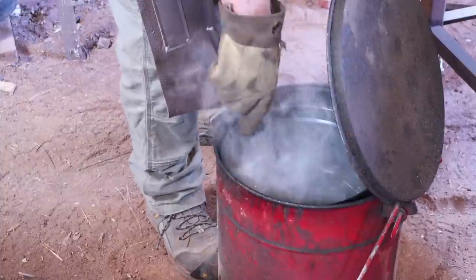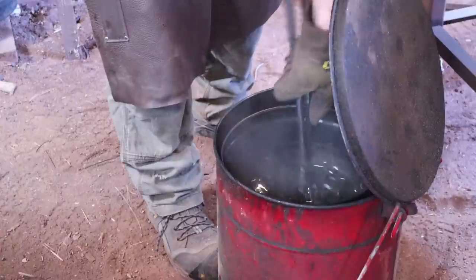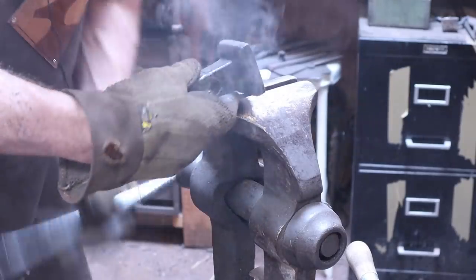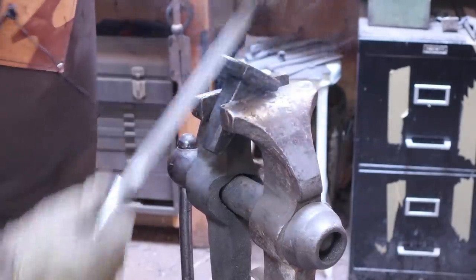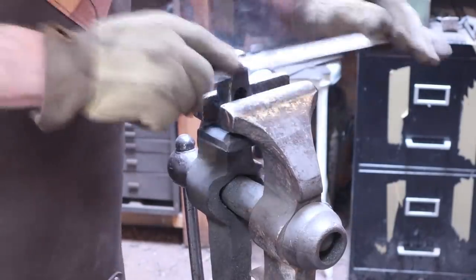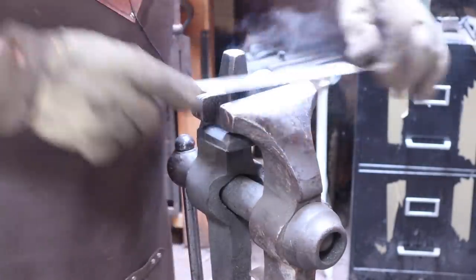I'm going to cool the entire tool. If we need differential hardness in the struck end, I will temper it further with a torch — that's a little easier and keeps the oil from burning as well. A tool this heavy generally causes the oil to flame, and that's really not the best idea. Let's go test this with a file and see how hard it got. Because my oil is good and hot, this is still too hot to touch, so I'm going to wear gloves. That isn't just glass hard — which is really kind of what we want — but it is certainly harder than it would be in its normalized or annealed state. It has probably decarburized some and the hard steel is going to be a little bit further down. I think we're okay and I'm happy with that hardness.